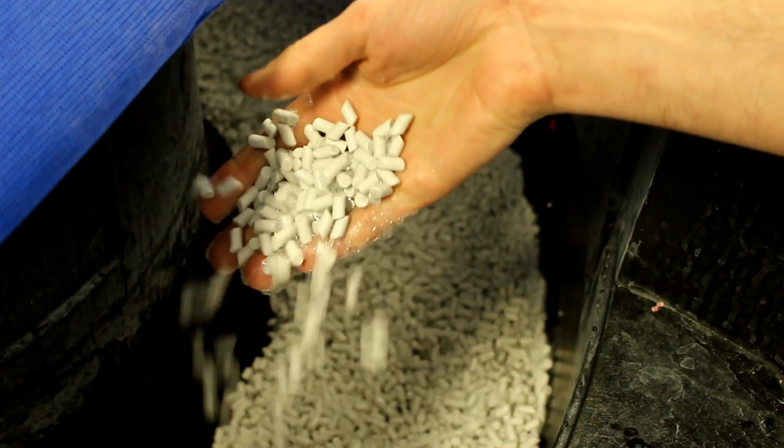After polishing, we go to dyeing. These machines make a rotating movement and are filled with pellets which scrape off the surface of our products. Why is that needed before dyeing? It creates a much more even surface, which also means the dye is absorbed more evenly — so the color is consistent across all sides of the product.